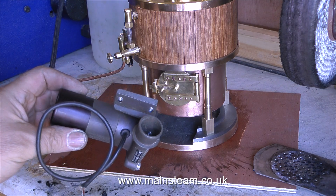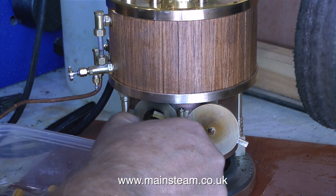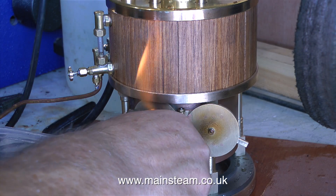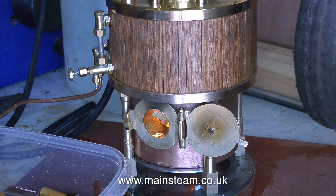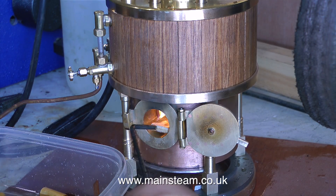I need one of these — this is a blower, or really it's a sucker because it goes in the top of the chimney and evacuates the air. I need to make an extension pipe so it fits in the chimney. Instead, what I'm going to do is fit a compressor pipe to the spare clack valve, and that way I can introduce air pressure into the boiler and open the blower. This is without the blower — and here I opened the blower valve and a jet of air went up the chimney — and look what happens: a bright fire. Everything is looking much better.